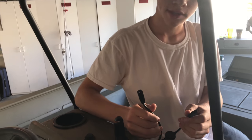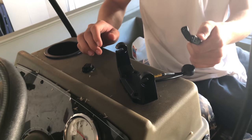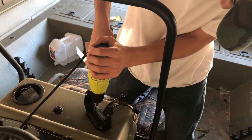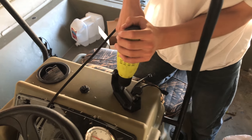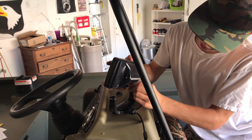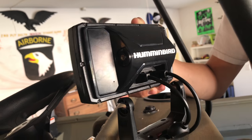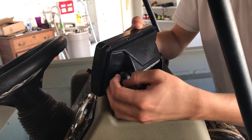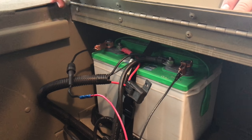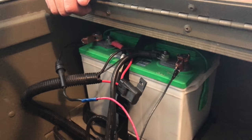Here's the transducer cable and the power cable — we ran them all the way up here. So now all we have to do is screw this in right here. I'll be ready to put the fish finder on and all we have to do next is just install the transducer to the back of the boat. I'm going to attach the cables in first and then attach it. So that cable goes right there and this cable goes right there. Both cables are in and now all you have to do is just put it on this. I attached the fish finder with these clips right here and it's working.